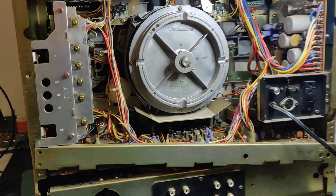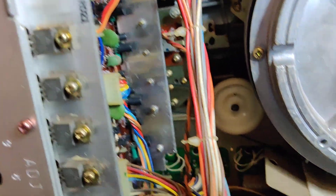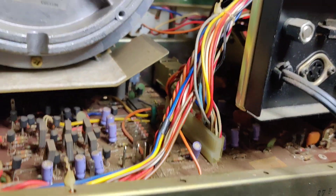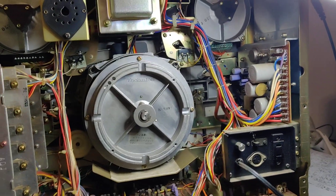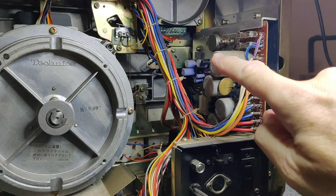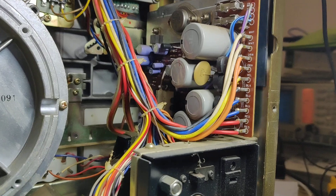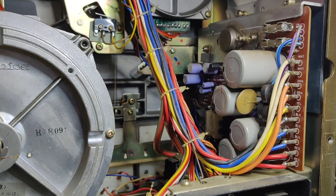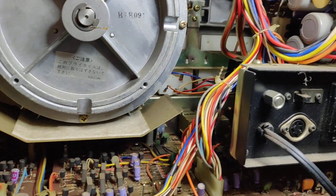The reason being is they are so complex and they've got so many transistors — hundreds of transistors in there — and I doubt whether any two faults would be the same. They're very difficult to get into as well. Apparently one of the faults that these have is that the capacitors are failing; they are getting old and leaky. This power supply here has some large capacitors, and they're always a favorite to go because there's obviously a lot more current going through these than the smaller ones. But any electrolytic capacitor could obviously fail with time.